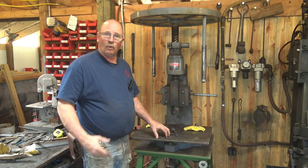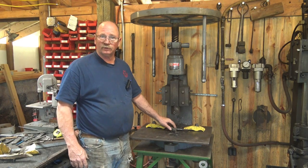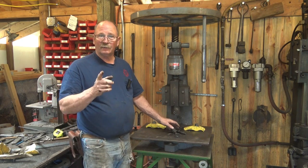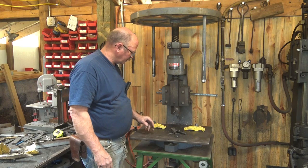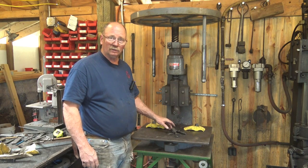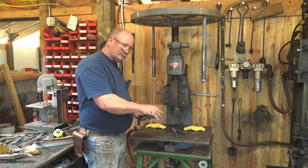That's the end of this part of the project. Why was I worried about being able to clamp things down? I don't use the fly press as much as I should, and one of the reasons is that I didn't have a good way to secure the really nice tooling I'd like to see under the fly press. Now I can secure it — it will stay put. That makes this ideal for repetitive tasks. One of the things I need to do is make a whole bunch of bottle openers, and I'm going to borrow an idea from Rigoni Ironworks and his little fly press punch. Being sure that the bottom die stays in perfect alignment with the punch is critical, and with just vice grips and clamp bars it was very easy for things to get out of adjustment.